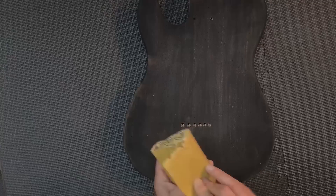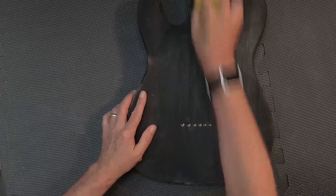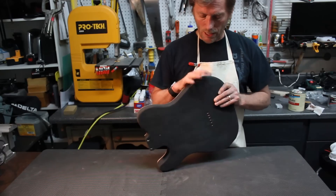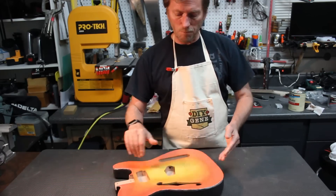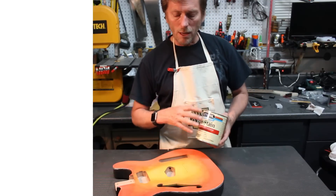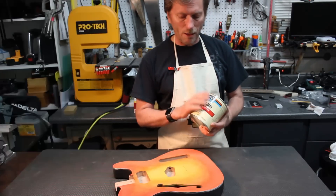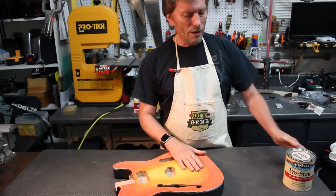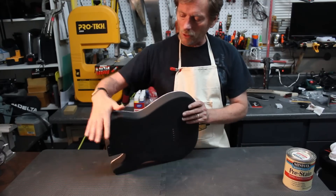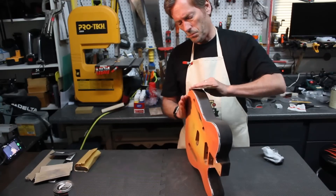Taking after it's dried, I'm going to take the sanding block and sand that down. I can feel that it's raised the grain, and that's my bad — I should have probably used a pre-stain that helps to raise those grains so you can sand them off and they won't come back up again. But I didn't on this and it's going to cost me. I'm going to have to do some work to smooth those back down and put a lot more time into sanding the edge down.